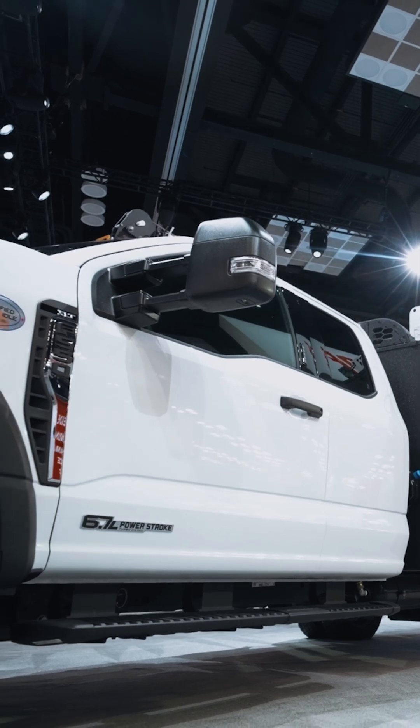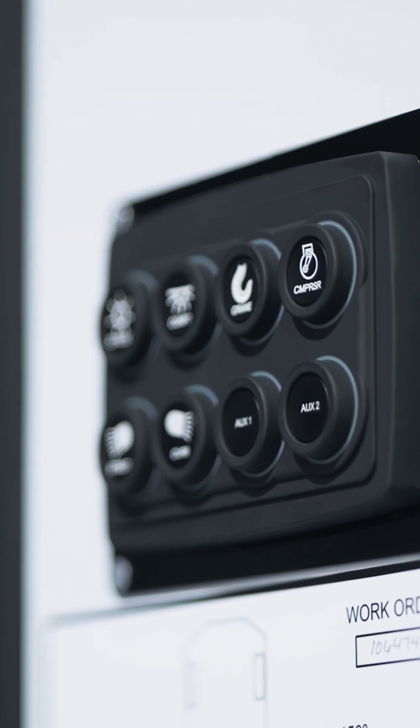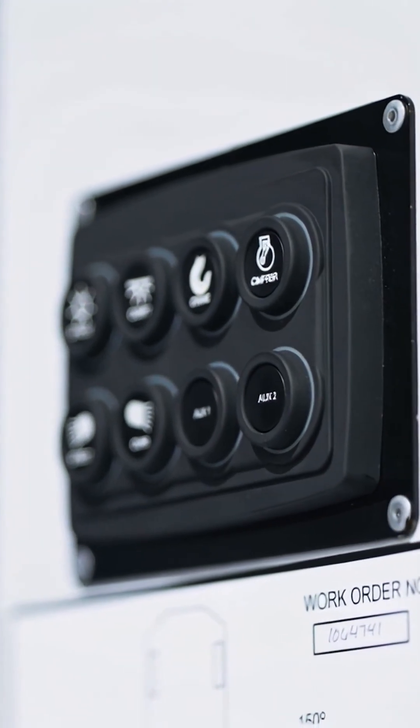In the cab, we have an LCD screen that has all the same functions as this, and at the same time it'll give you air compressor operation hours and crane operation hours. They use that so that they can schedule their maintenance properly — they'll be able to see exactly how long each piece of that equipment ran.